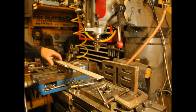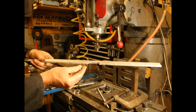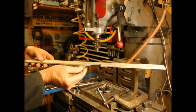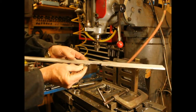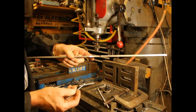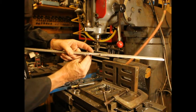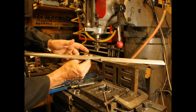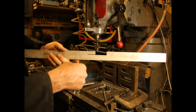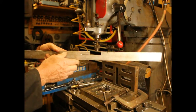The last thing was balancing it right between the two set screws, so when it's hanging on the blade the weight won't influence one end to the other. I clamped a nail in the vise right between the two set screws and trimmed whichever end was heavy until balance was achieved right in the middle. The blade will be under tension when you're checking, so it doesn't have to be perfect — but you don't want any false reading, so get the balance point right between the two. It's a pretty simple device, but it made all the difference in the way it cuts.